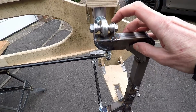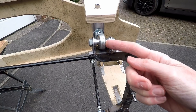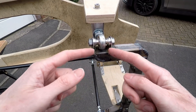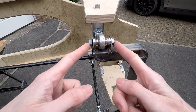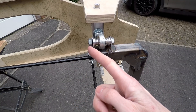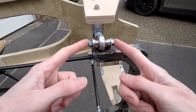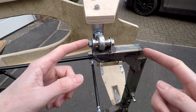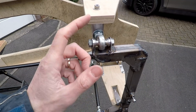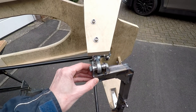Moving up to the top of the linkages here, this is the 10mm rod end with the misalignment spacers that I showed you in my last video. We've got two M8 nuts left and right and a length of threaded M8 rod going through holding it together. I might replace this by a slightly better stainless steel cap screw in due course. You can see that I've chosen to align the rod ends vertically like this, so in essence you've got unlimited tilt from that respect.